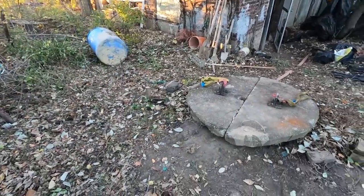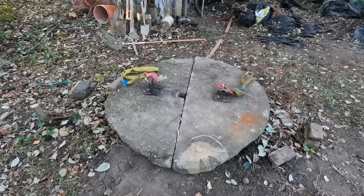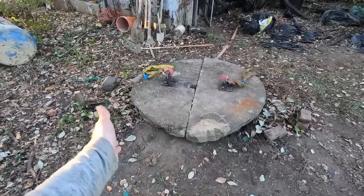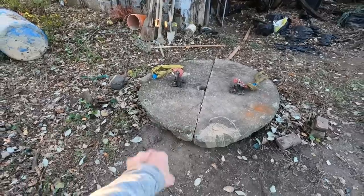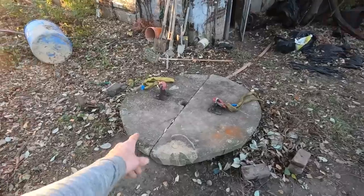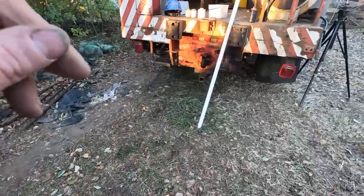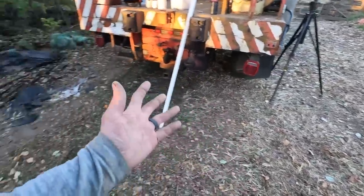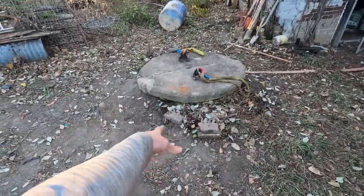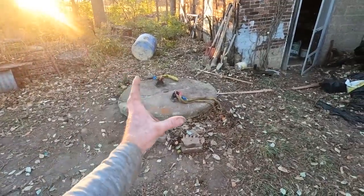All right, we're back. So it is already like 4 o'clock at night. We're gonna pull this off and try and lower the foot valve. Essentially, we basically just extended it enough to be able to pump some water out, and we used some duct tape and a bunch of other random redneck riggery to get it working. It lost its prime because I'm betting that the pipe down there came off. So the plan will be to extend the foot valve with this PVC. Got some fittings, got some glue. And so he's gonna go down there, get the foot valve, pull it out. We're gonna take the whole chunk of pipe out, fix what we need, and then put it right back in, and it should be good to go.